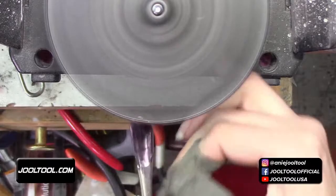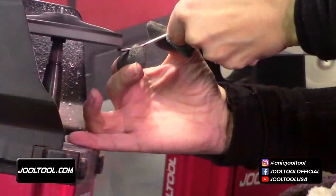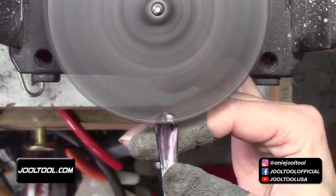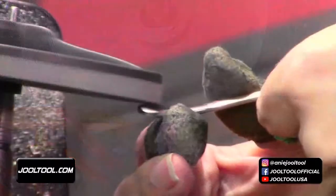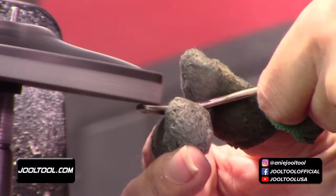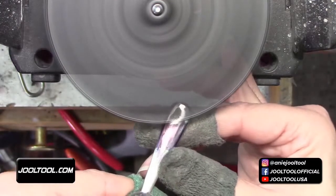Okay, there we go. All right. So here, you guys, again, establish a good footing with your pinky. Pinch it and just hold it like this. Do you guys see this? Just hold it there. Don't do nothing. Just hold it and glide. Slow rotation. Slow. Slow, you guys. Slow. If you do it slow, you won't miss a scratch. Kind of tilt it a little because my lines are going like this. So either tilt it like this or tilt it like that. Whatever works easy for you.